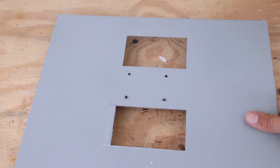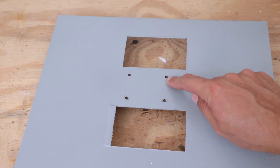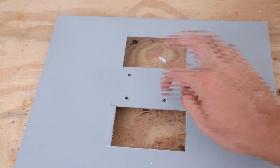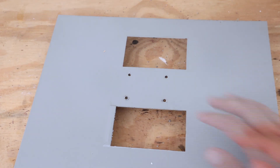So now that we've got our holes drilled, we need to flip the panel upside down. On the back side, we need to file down where the drill bit came through, as there's going to be metal protruding. The screws that are going to go through this need to sit flush with this panel, so we need to really get these down flat.